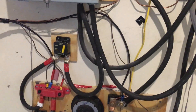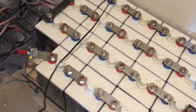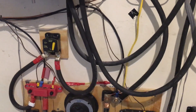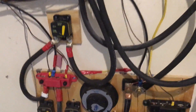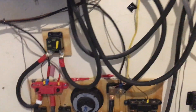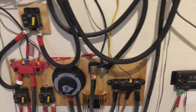Overall: you have your batteries, your inverter, and very thick-gauge wiring — this is welding cable. With nickel iron batteries I can pull a lot of amps, so you want wiring sized to facilitate that without worrying about overheating. Even though this is a 24-volt system, the terminals don't really get hot when pulling amps — they just don't, though I haven't measured it with a temperature gauge.